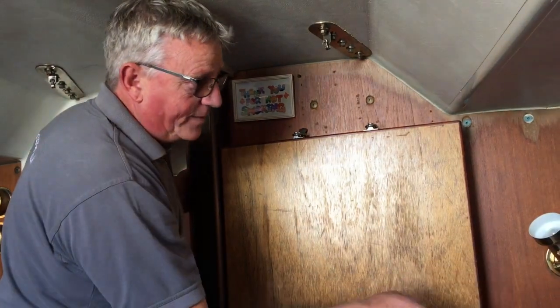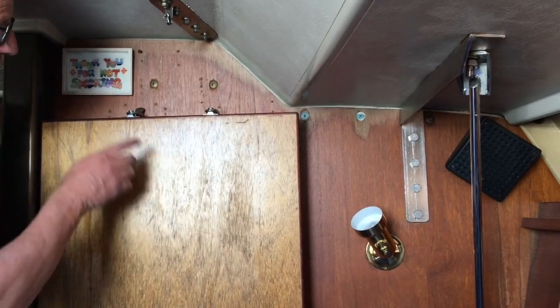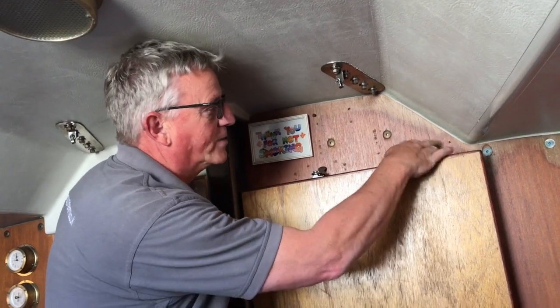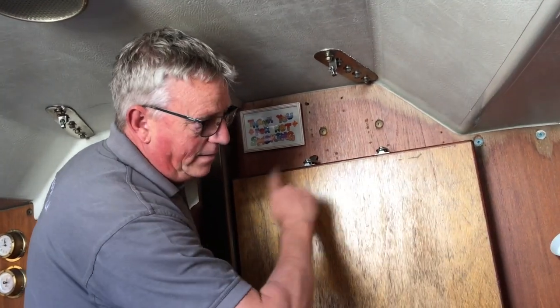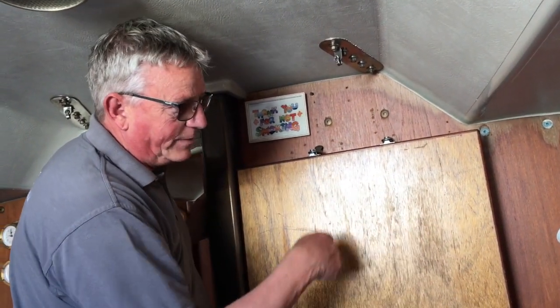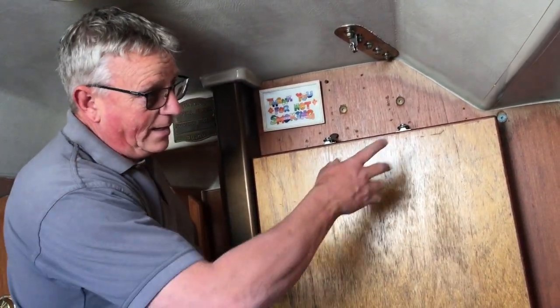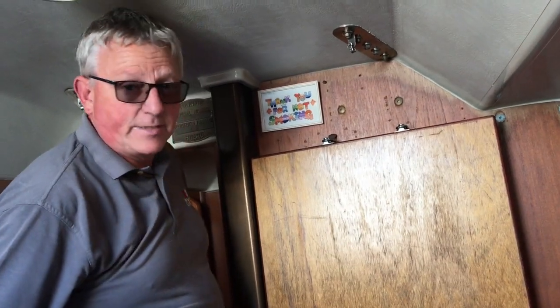This is not a conventional way — most yachts haven't bolted down into the side of the hull. In this particular model they're relying on the main bulkhead here, which looks like 12mm ply with loads of reinforcement on the other side with the heads arrangement and the wet locker arrangement. I'm pretty happy with what I've looked at so far.